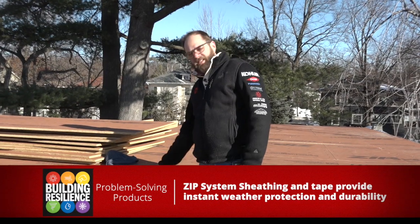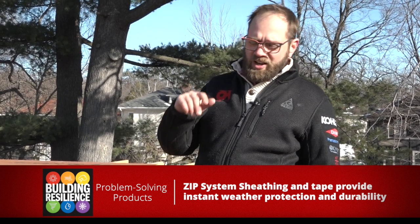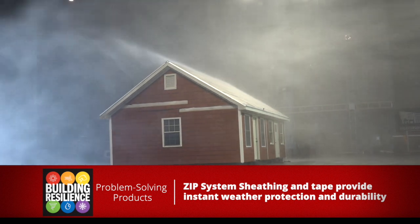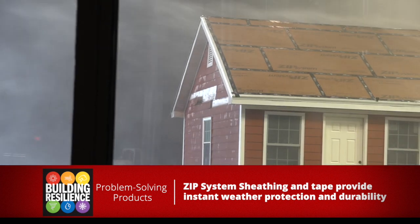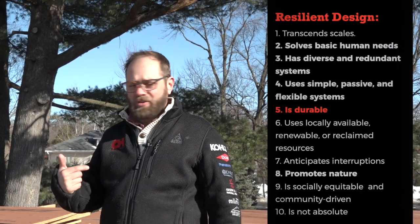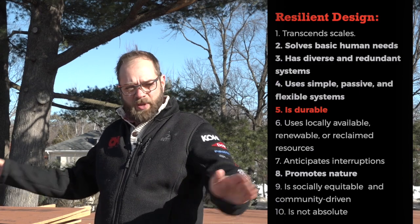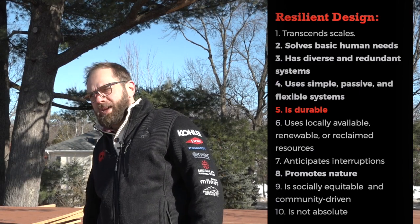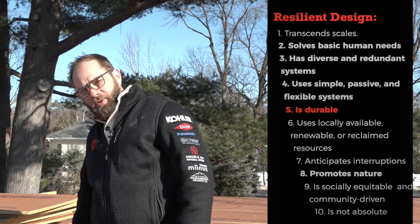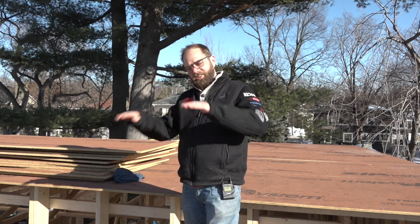This is the first time that we've used the Zip roof decking and we're actually pretty excited. We saw that video showing how well it stands up under hurricane-force winds and rain just being taped, and that adds a degree of confidence when we're framing out a flat roof like this. We love EPDM, we love flat roofs and TPO — they work really well — but being able to be dried in while we work before the roof goes on is going to help us with our timeline. And if there's a failure in the EPDM at some point, the likelihood that we'd see that come right in right away is lower, so that's like an extra layer of protection.